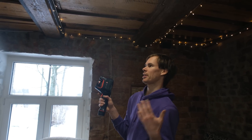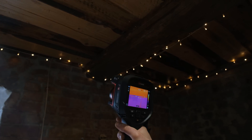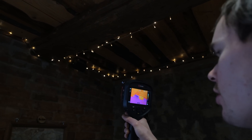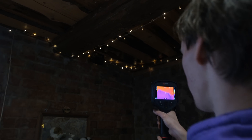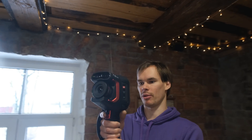Going across the walls there's a bit of cold, and also the top of the bricks can have cold sneaking through since the bricks are no longer hollow — the brick has to cap off so they go solid through. Around the windows it's also quite cold at about 11 degrees, but realistically nothing that's a really big cold spot yet. We're going to look at more of the colder sides of the house since this is the warmest room. The coldest spot in the corner where the stove is is 20 degrees, which isn't really that cold.